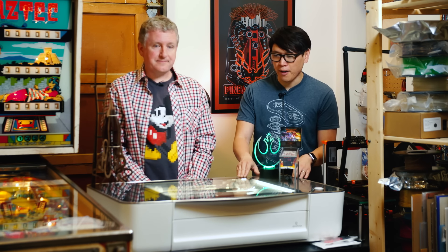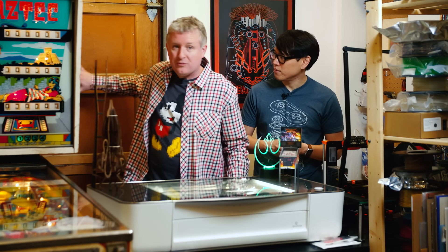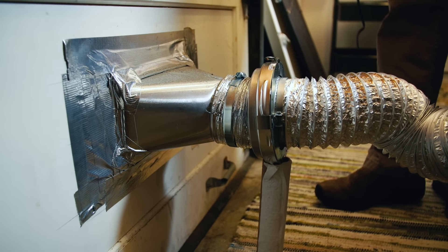Let's talk about setup. One of the advantages is that it's a simple setup. You have your Glowforge in your garage, and I have mine set up in my home office. One major consideration is ventilation — probably the biggest consideration. They launched their own crowdfunding campaign and one thing you could pre-order was their filtering system, which they still haven't shipped. So we both needed to find a ventilation solution. There is a dryer duct vent on the back, and I connected a vent to one of the existing holes on my garage door with a cool magnetic contraption — whenever I want to use it, I just slide and connect it.